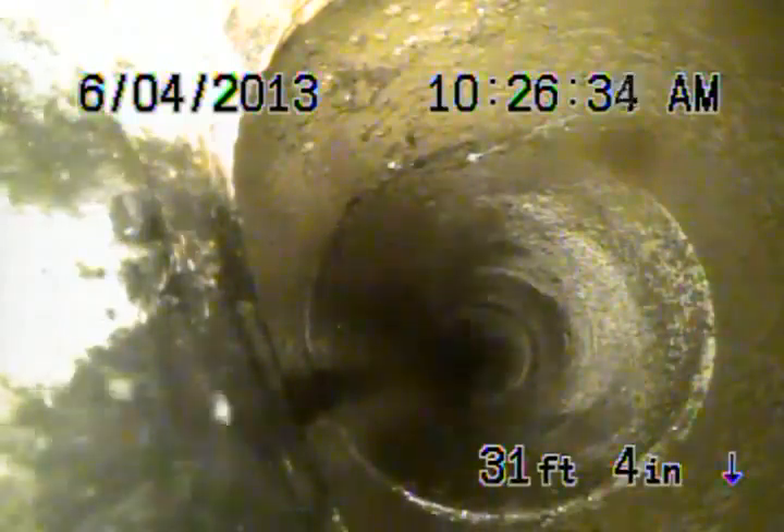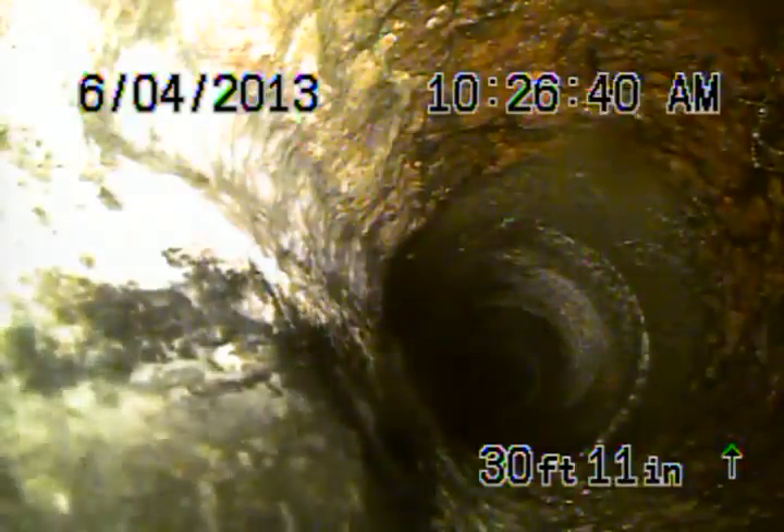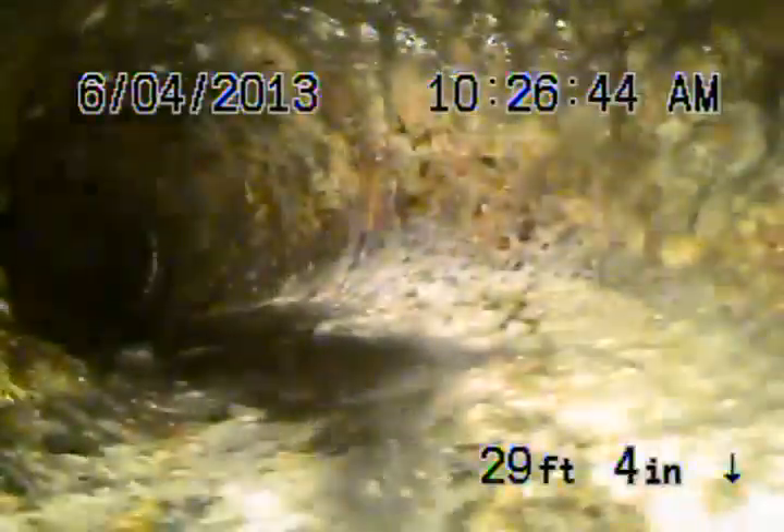So this is a four-by-six transition, approximately about seven feet two inches deep at the sidewalk level. I'm going to bring the camera back. The transition is to a four-inch cast-iron pipe, which does have a slight rust buildup on the inside. You can see it's in pretty fair shape — we don't see any cracks or breaks in the cast-iron.